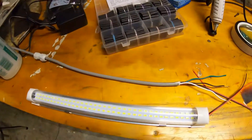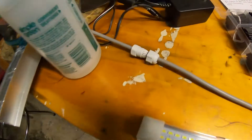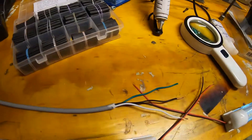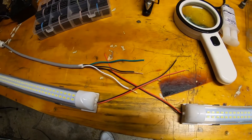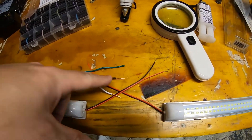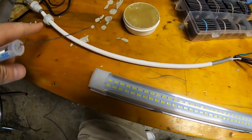I'm stealing some old appliance power cord from an old floor steamer — that connector from this cable actually fit perfectly over this existing cable, so I'm just going to steal a foot or two from this old appliance cord. I'm going to wire it up here and put some heat shrink on there. We're going to use the black wire for red and the white wire for black. Wire color doesn't really matter as long as you're consistent. I've got a big section of heat shrink tubing sitting on this cable and two smaller sections on the black and white wires.